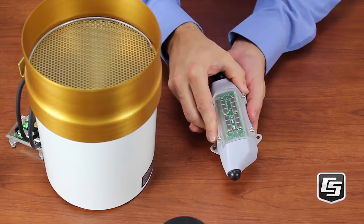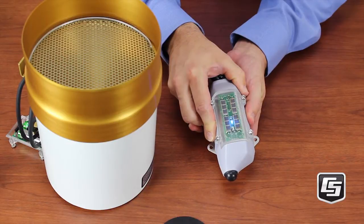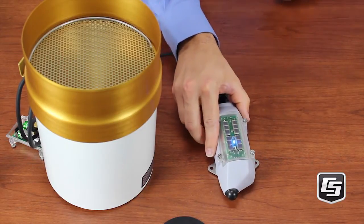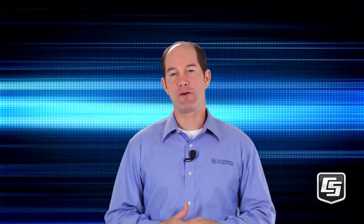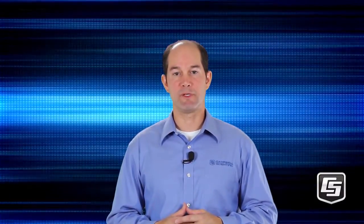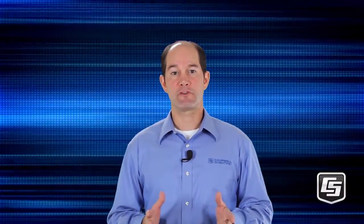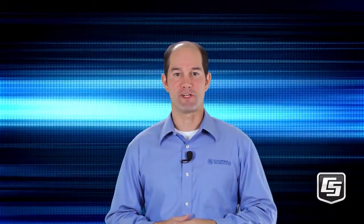Now press and hold the setup button. The blue LED light will flash up to four times, indicating how charged the battery is, then will stop flashing. Keep the setup button continually pressed. About four seconds later, the blue LED will start flashing again, about once per second, as the sensor searches for the base station. You can release the setup button now. The wireless sensor is now in auto-discovery mode. You're waiting for the sensor to establish communication with the CWB100 radio. Establishing the radio link may take five minutes or more. Patience is important at this stage of the network setup.